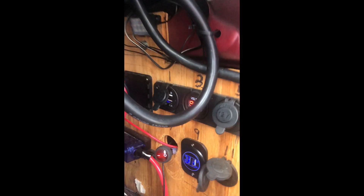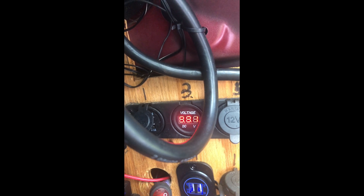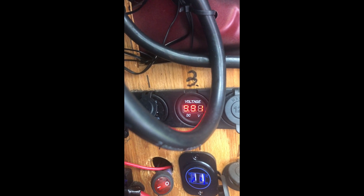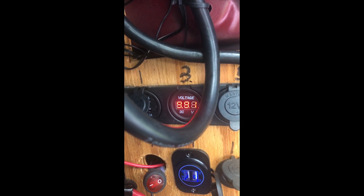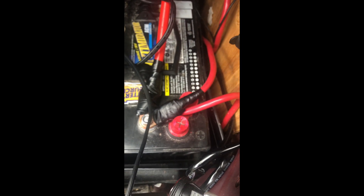Here's my simple voltmeter — instead of reading 12 volts, it reads 9.91 volts, so the battery is definitely almost drained. This is a 130 amp-hour AGM battery, and it's done its job well — it's just out of juice at this point.